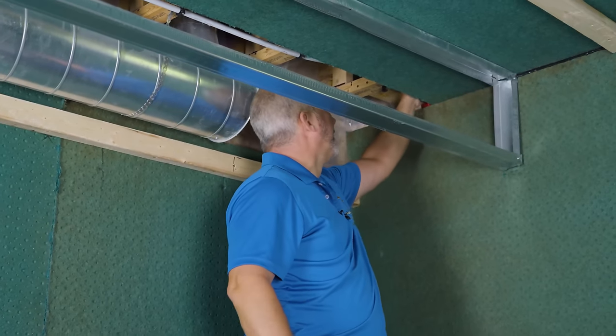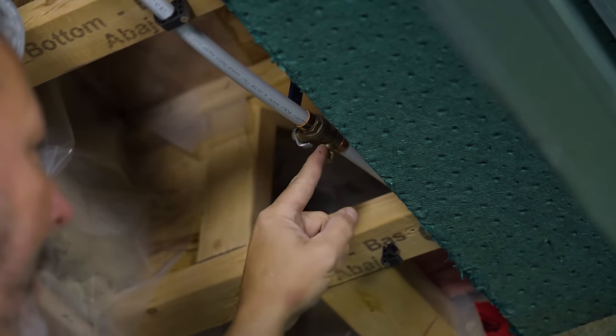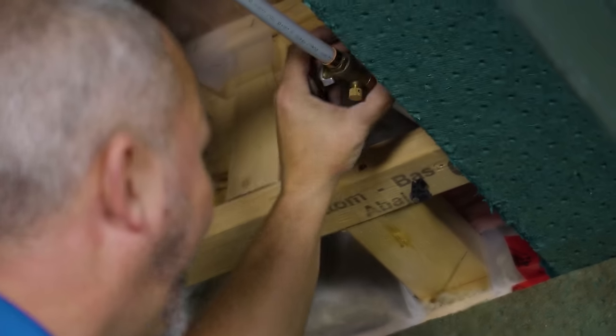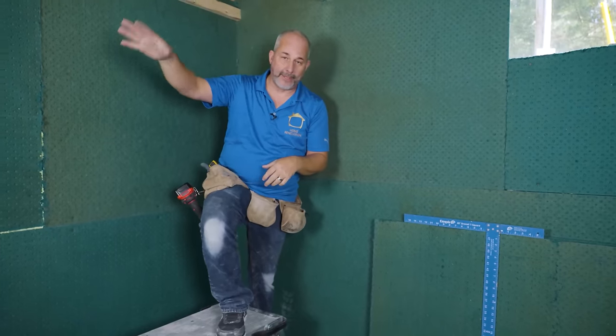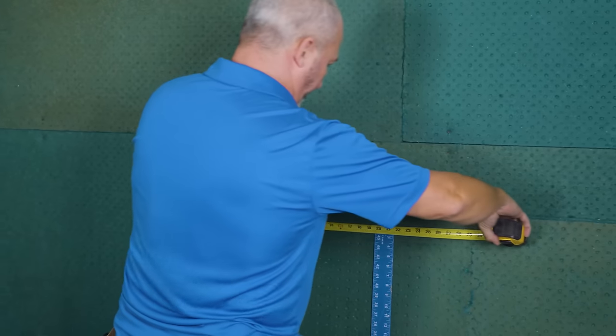They're using a quarter-turn shut-off valve and a bleeder valve rather than a frost-free line. When you turn the water off and open the bleeder, whatever water is in that line drains back into the room — have a pail ready — but it guarantees there's no water in your hose bib. The other way is to turn it off, go outside, and vacuum the line out. Now I'm putting a first piece of green board here — 26 and 3/4 is my measurement.